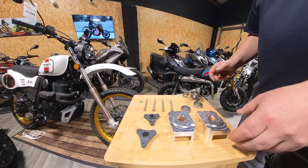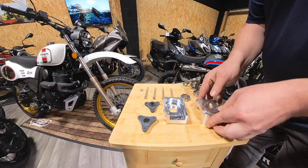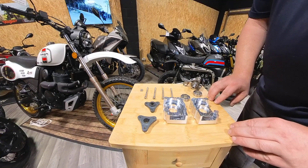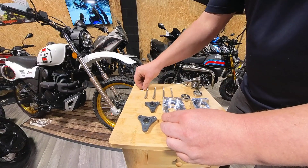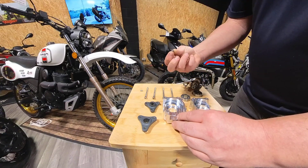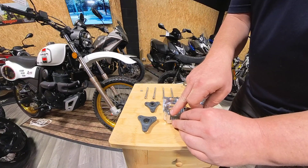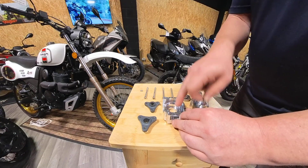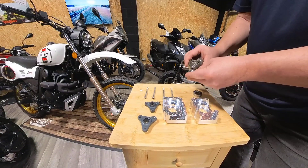Let's move down to the table so you can see fully. We've machined the two halves. Let's have a go together to see if they fit. The first thing we're going to do is put the locating pins. I already know these are too big to go in there, so I'm going to make some little pins to go in there, because I don't want to reduce the wall thickness any more in these areas. I don't want it leaking. So we'll forget about those for now.